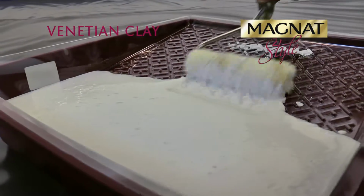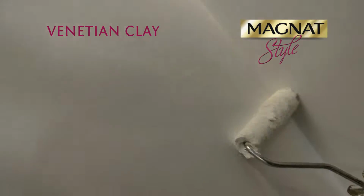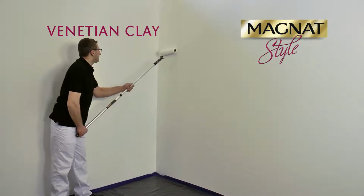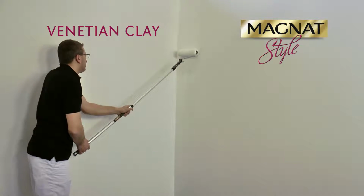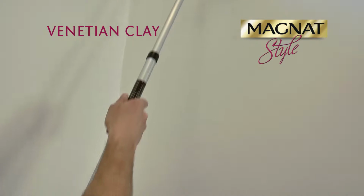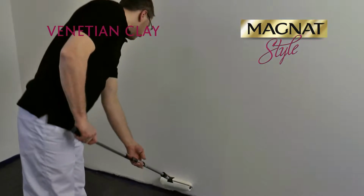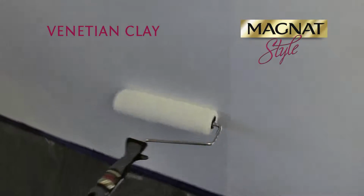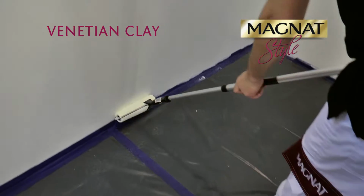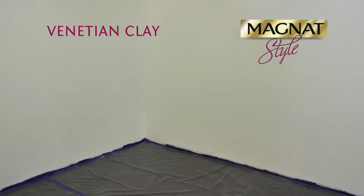Coat the new or previously primed surface with MAGNAT style undercoat. The paint contains fine-grained quartz sand. Its application guarantees the proper adhesion of decorative layers. It's best to apply the paint with a roller in 1 or 2 layers that must be uniform in texture and color. The recommended drying time is about 2 hours per layer.